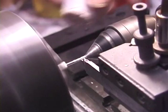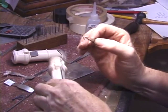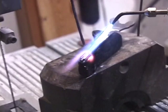Here we're making the tiny silver ball-ended joint that will go on the long C key. This will become clear to you later. I prefer to make this separately, and glue the whole assembly together to make sure the mechanism is working sweetly before I finally solder the ball-ended joint onto the end of the long C key.